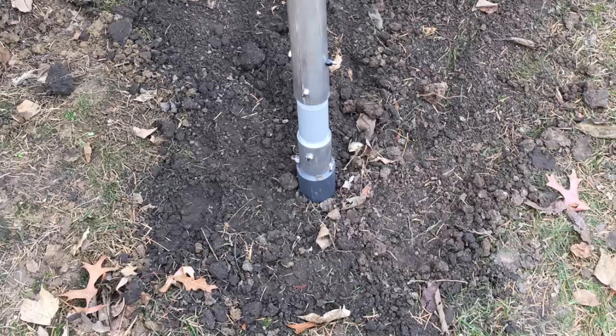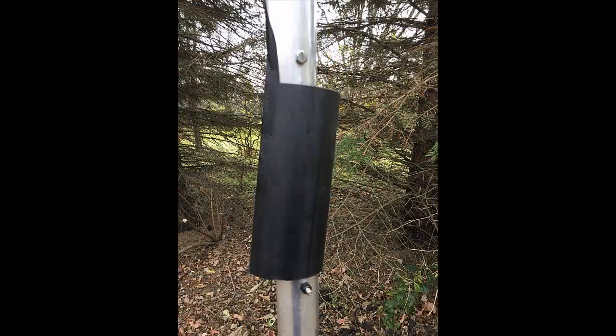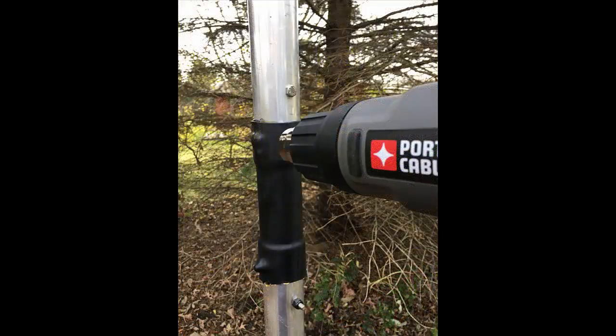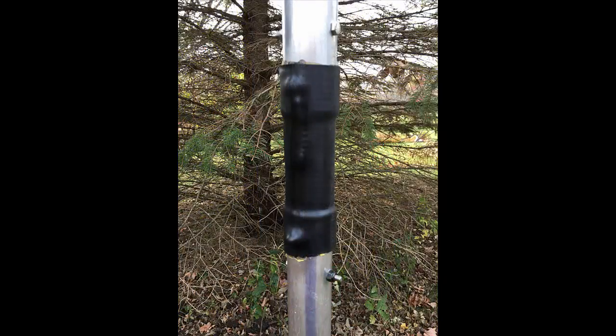Once I had the antenna erected, my next step was to install a piece of shrink wrap tubing over the center insulator of the vertical dipole. This is a piece of heavy duty shrink wrap and requires the use of a commercial quality heat gun. The inside of the shrink wrap tubing contains a hot melt adhesive, which helps to seal the feed point of the vertical antenna. Here you can see the shrink wrap after I finished, with some of the adhesive protruding from the bottom.